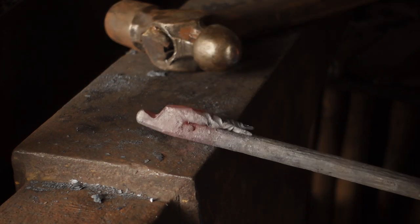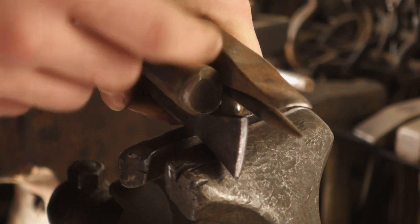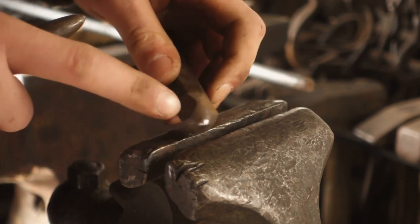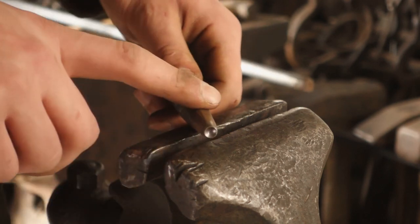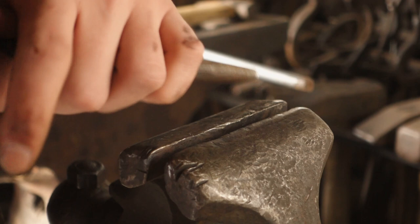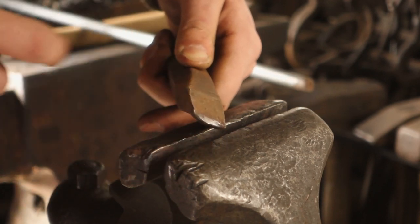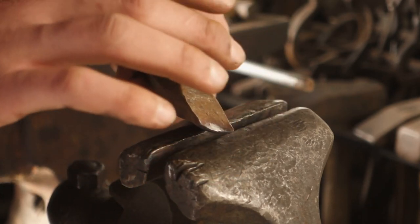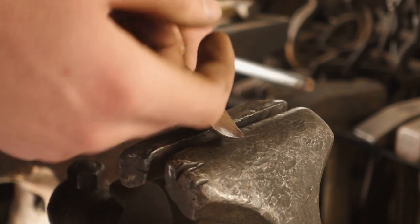That is our basic preform of the head done. So these are all the tools that I'm going to use for the facial features — a lot of people have asked to see close-ups of these tools. The first tools I'll use are a sort of center punch to get the nostrils set, and then one to widen them out — that's a much steeper angle, so it's going to make some wide nostrils. The next tool is for the eyes — basically just a hemisphere with a nice sharp edge around the sides, so we can drive that in and push the material out for the eyes. Then I've got a curved chisel for the mouth, which is what makes the animal heads look happy — maybe not something we want on the serpent's head, but we can put this in to make a wide opening or mouth. And I'm thinking maybe I might put a tongue in the mouth — I think that might be quite cool.